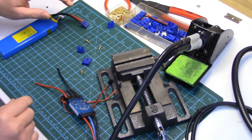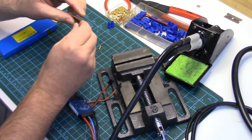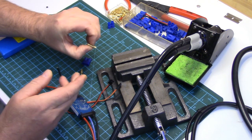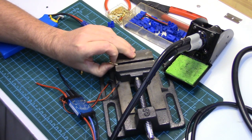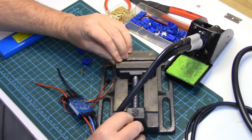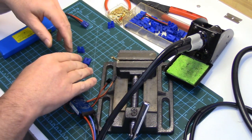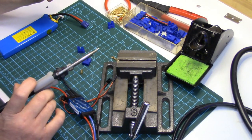Here's our male pin. What I like to do is insert it into a female pin and then mount it in something to hold it nice and sturdy. I use my little drill press vice — you could use anything. The drill press vice has lots of mass so it holds things really steady. I usually mount the pin at about a 45-degree angle so the solder won't flow out.